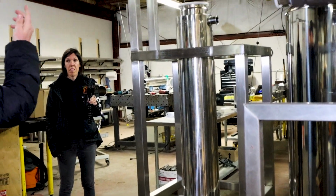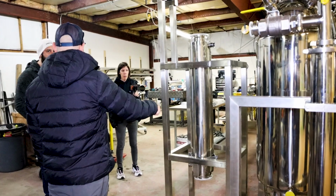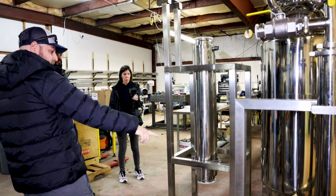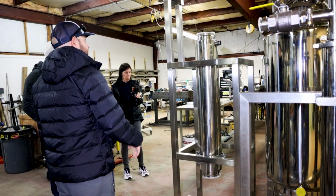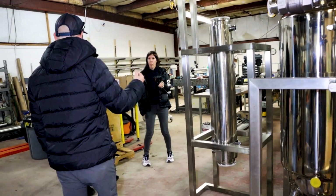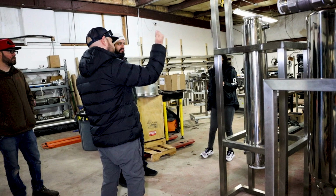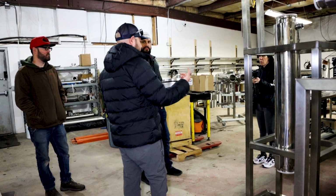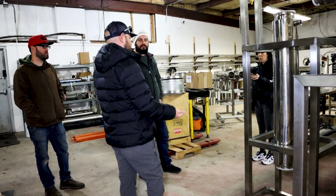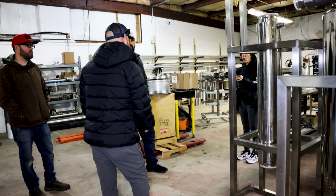And it's still vapor though? Yeah, but it's cold to the touch. You can grab the hose and feel it cool. Then we could technically just run air on it and get it back to a liquid, so we condense it back to a liquid. And then it goes through a subcooler. Like how everybody else does the coil, we just have a really long path.